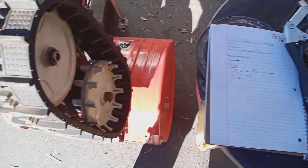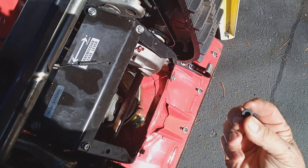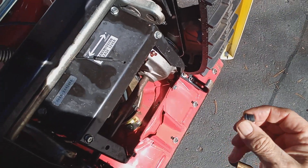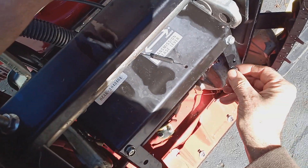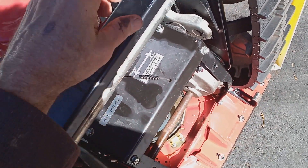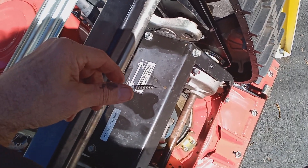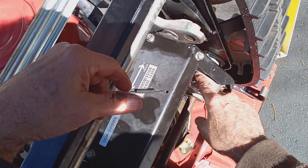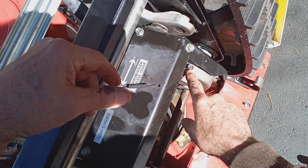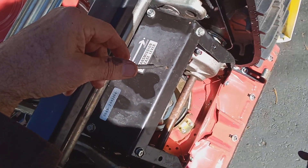The last thing I do is put a little rubber cover on the zerk to keep it clean. You can get these at the hardware store; I buy about 50 at a time on eBay. If the cover comes off during operation, don't panic — it may get dirty, but no water or dirt is going to get into the grease zerk because the only way it would get in is under pressure. Next fall when you need to put in more grease, just clean the zerk fitting thoroughly before you pump in new grease.